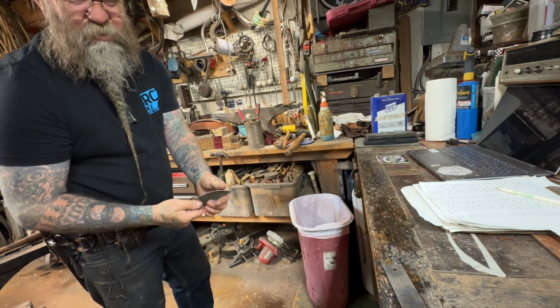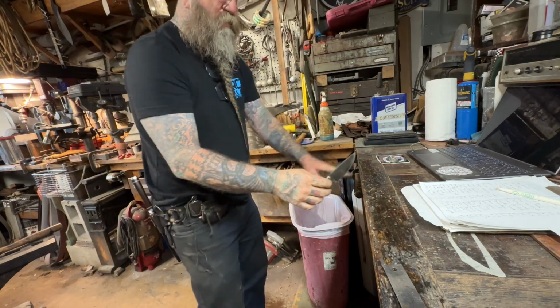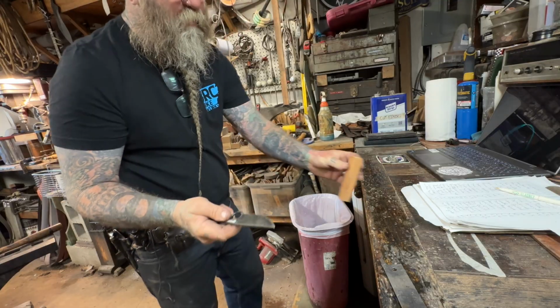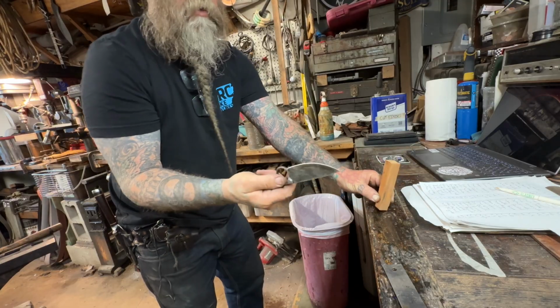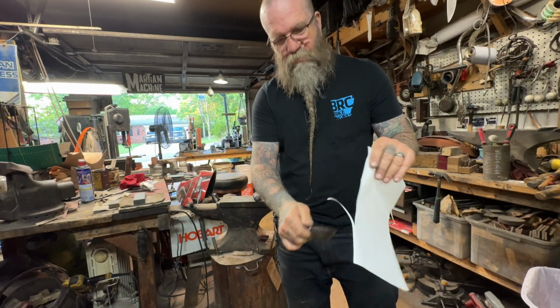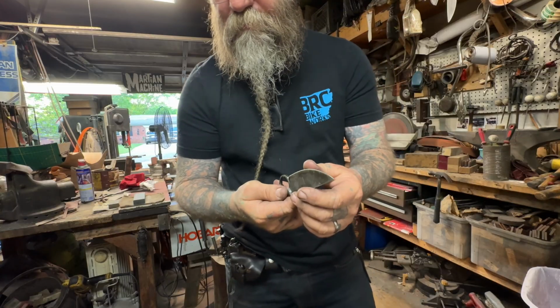that burred edge. One other thing you can do is, like on a piece of wood, now to be honest, I prefer, if you do it on a piece of wood, to do it on the end grain. Make sure you don't cut your thumb off, but if you just drag that across there, it pulls that burr off, and that Buck is sharp. After just a few strokes on the stone, she's dialed back up, nice and sharp.